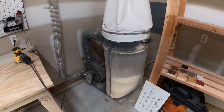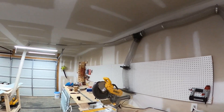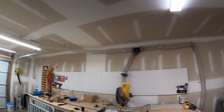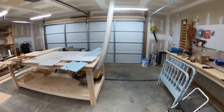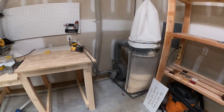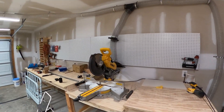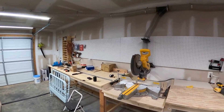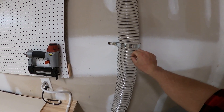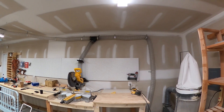There's the dust collector — you can see we've been using it a good bit. I use flex hose for this. If you're going to install a dust collection system in a huge area — more than about 40 feet of hose total — or you have a really weak dust collector, I would recommend going with solid pipe and only using flex hose when necessary, like connecting directly to your tool. Flexible hose has a lot of friction because it's not smooth; there are indentions that restrict airflow.